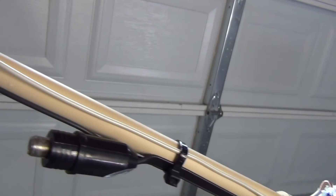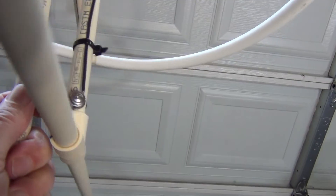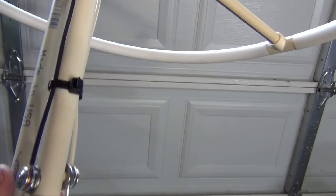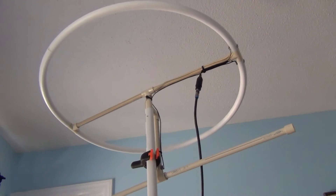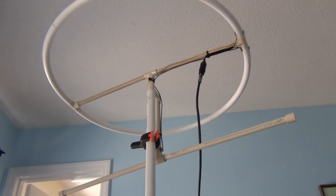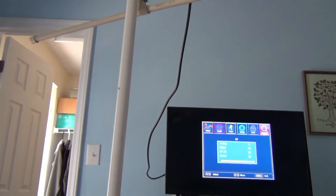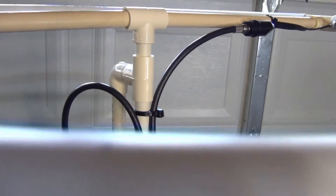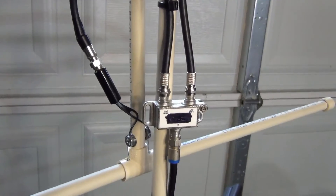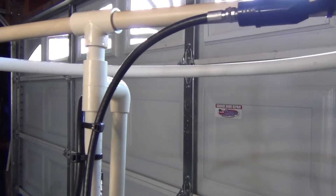There are two ways to wire these together. First, you can run leads down from the UHF antenna to the VHF terminals and attach your matching transformer there — make sure the leads are the exact same length. I tested this configuration and it worked fine for the VHF, but I did lose reception for a couple of UHF stations. The other way is to use two matching transformers, two short and equal lengths of cable, and a combiner to bring the signals together. For me, this worked much better and I didn't lose any stations.